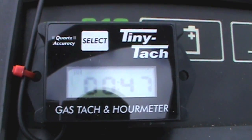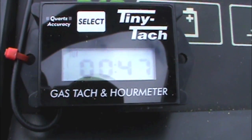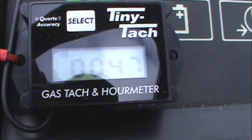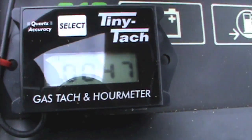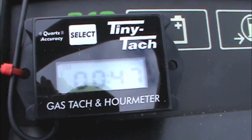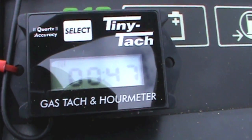Right now there's only 47 minutes on the hour meter. The minute you turn the key and the engine fires up, the hour meter switches over to your tachometer. There's also a job timer, and you get to that by pressing the select button. You can time oil changes or how long it takes you to do work, and it is quite handy.